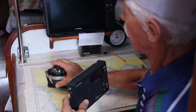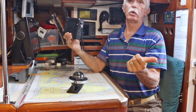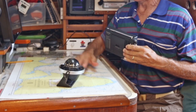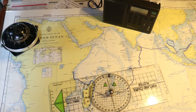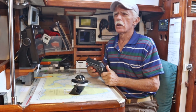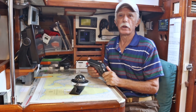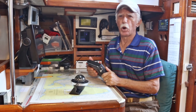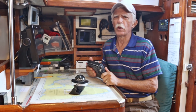You set up a compass, figure out variation and deviation, determine the null, and get your compass heading to that station. Plot that heading away from the known radio station and you'll have a line of position — do that with two more stations and you'll get a fix. The problem is these days there are no more RDF stations that I know of. In the old days they were everywhere along every coast with three-letter Morse code identifiers. Now you have to pick up AM broadcast stations and just hope it's in a language you understand.